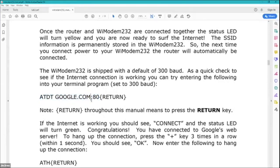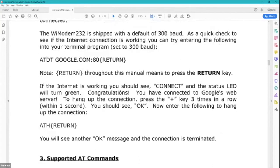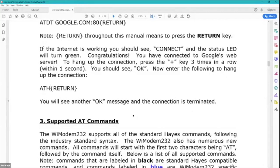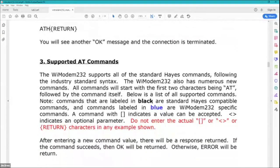Instead of a telephone number, you actually have a URL, a colon, and a port number. If you type that in, you'll actually connect to Google's server — not that it'll give you any data back, but it gives you an idea if it's connected or not. Then just like the old school, type +++ to get back into command mode, and then you can type ATH to hang up the modem — exactly like the old school commands. If you're familiar with modems from back in the day, this is exactly like running a real modem. There is no difference whatsoever.